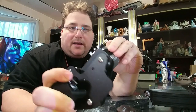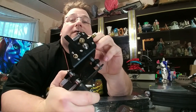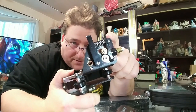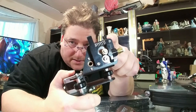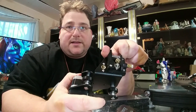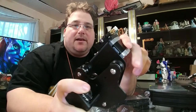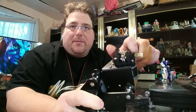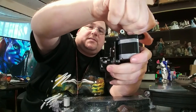That is a beautiful feeder assembly. My only suggestion for a revision would be to beef this up — put a little gusset right there between this piece and this piece here, because the natural tendency is to grab and squeeze it. However, as this mounts on the printer you're going to be gripping from the front, and your finger is going to sit right here, so that's plenty strong. That is a good design — I like that a lot.